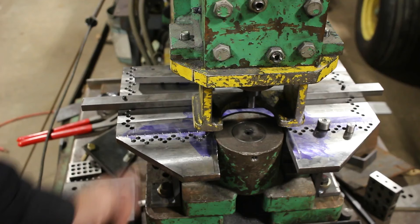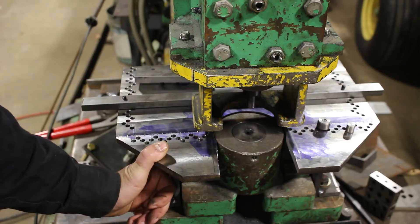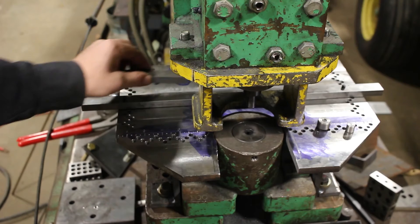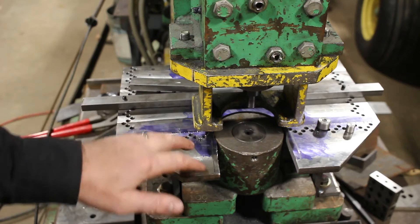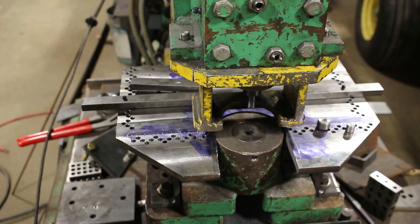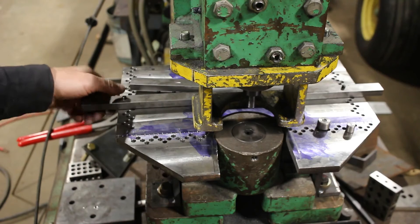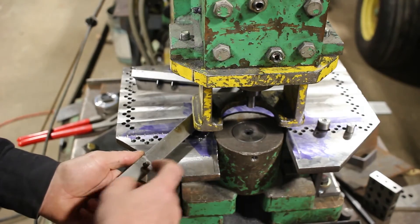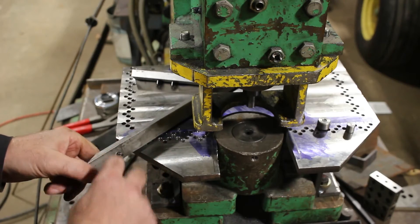It's still perfectly functional right now. Even though I had a bunch of other spring projects that were more important, this peaked my interest and got me going. The holes are quarter-inch clearance — F drill holes, so 0.257 rather than 0.250 — and they all worked. I did have to modify the pins because some of the holes stick a little bit; I just ground a little on each side to keep the same distance up-down and in-out, but that makes them drop in a little bit easier.